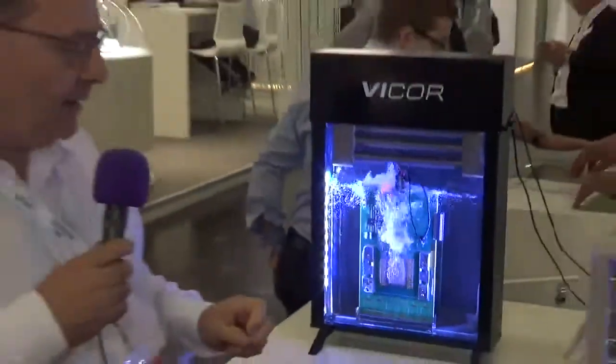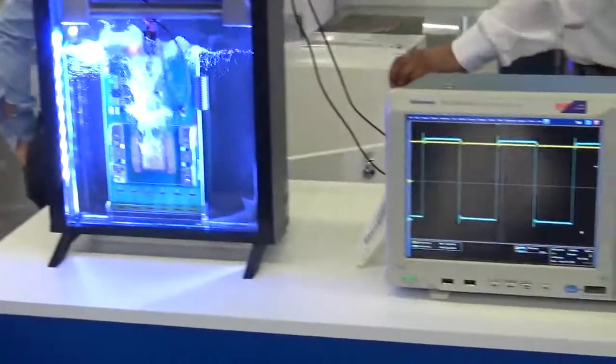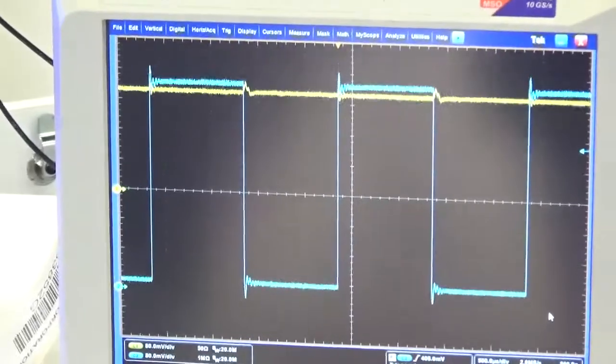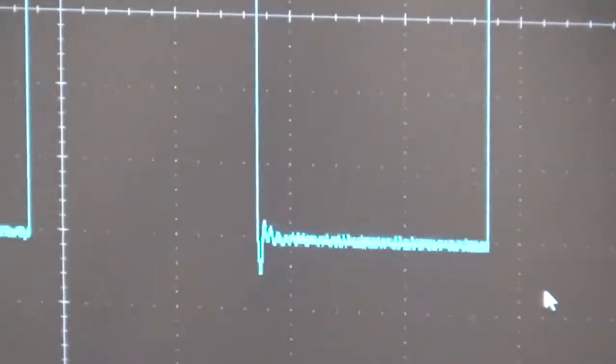The way the system works for regulation is that we're feeding in DC at about 55 volts. The driver inverts the DC and turns it into a pulse train that has an average current fed to each of the multi-chip converters on the level of about 1 amp. The multipliers bring that current up to 200 amps apiece, and that's fed into the load at about 0.8 volts.